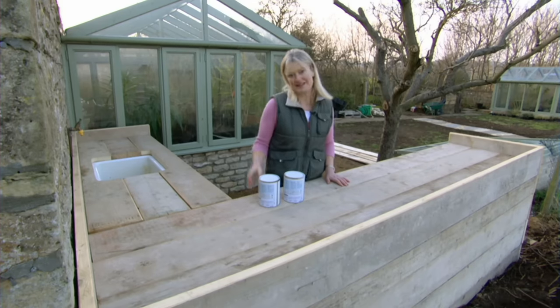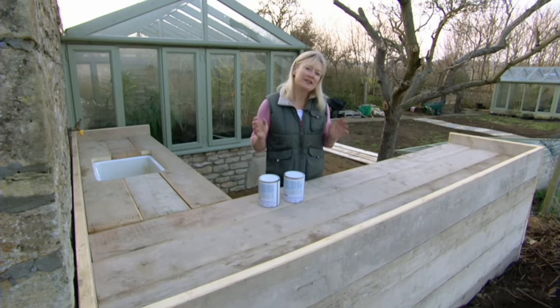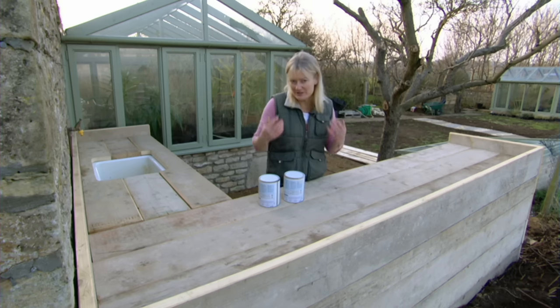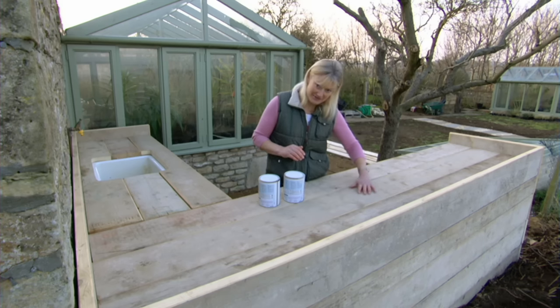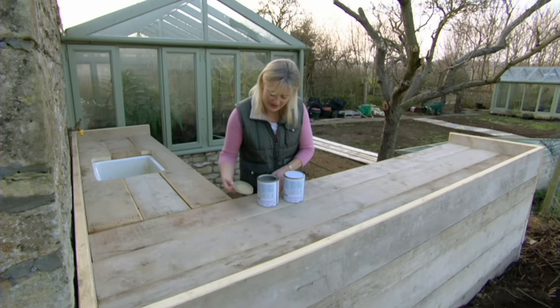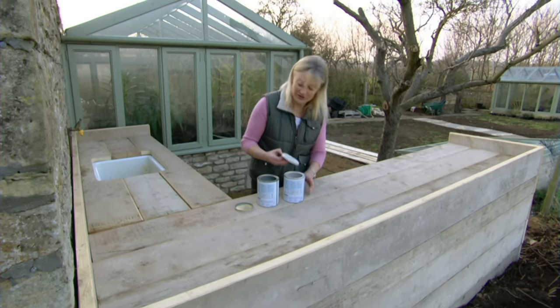I love these old planks but I think they could look a whole load better. I'm going to try and make them look like old oak rather than cheap old pine. I've got these translucent wood stains — they'll get sucked through into the wood and you'll see the grain through them. I've got a light grey and an antique grey and by mixing the two together I'll hopefully get exactly the colour I want. With an ordinary paint it dries darker, but with a wood stain it can dry a lot lighter, so just be aware of that — put the first coat on, reassess when it dries, and then apply the second coat accordingly.